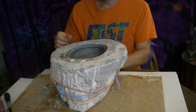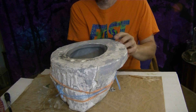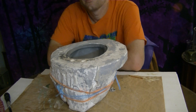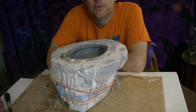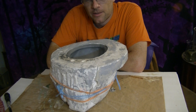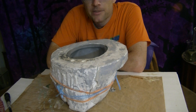It's not quite so squishy now. If you let it dry out too much it will start cracking, you'll develop other problems, and it won't be as easy to work with. And if you try to take it out too early when it's still too liquid, it's going to be unmanageable — too malleable and it's just going to deform very badly. The description I've heard from other people as to the best consistency is a leather-like consistency.